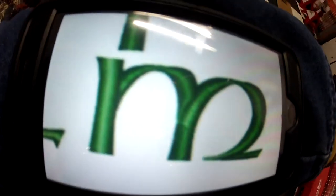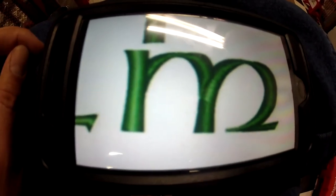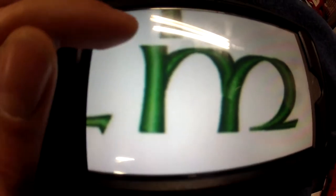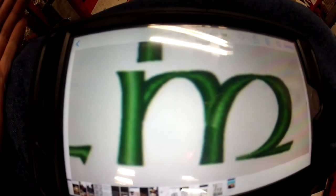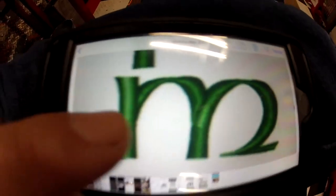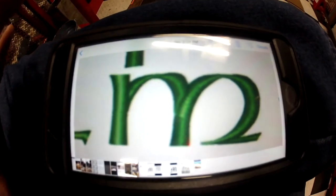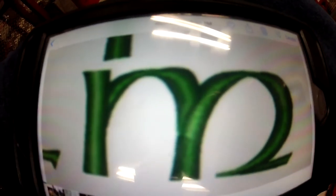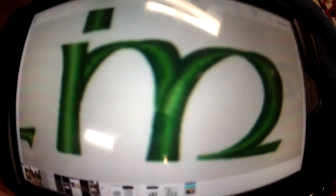Today we are going to make a steel letter M. This was a picture that the customer sent me — he wanted it to have a height of 15 inches. Using a ruler I measured on the screen from here to here, divided 15 by that number, and that gave me an overall value to measure and scale everything up to meet that set value of 15 inch height. Very fiddly and frustrating, but sometimes you gotta do what you gotta do.